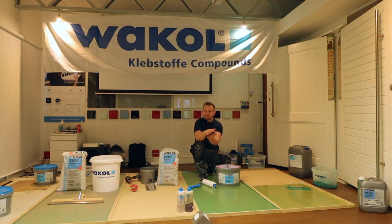If you apply primer on a non-clean tile, you will put the primer on top of the maintenance product and there is no connection to the tile. That's why you must clean it — use something aggressive to make sure all residues are gone. Then you're safe and can keep going to the next step.